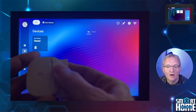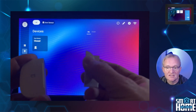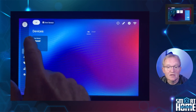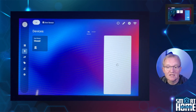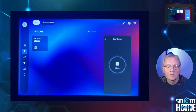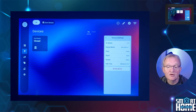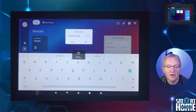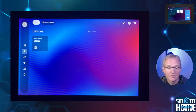Now let's do a quick test — opening and closing the door contact sensor displays on the tile in under 1 second. Now let's rename it so we know which door contact sensor is which. Select the door contact sensor tile, press the three dots in the top right of the preview screen, press device name, type in an appropriate name, and press Save.